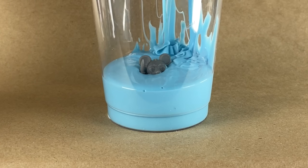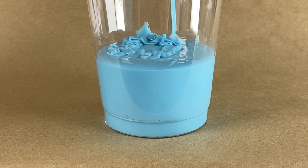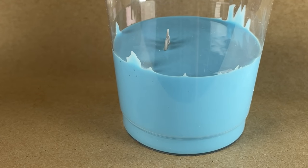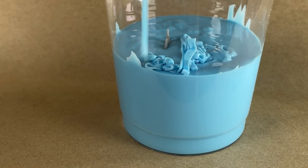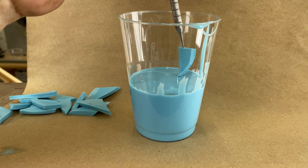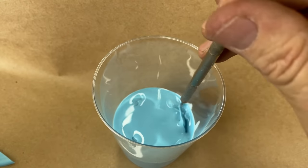I'm kind of waiting now because I see a gap between the sword and the ear and the side of the face, and I want to see that rubber rising up in there. Give it a nice eighth of an inch, quarter of an inch maybe, of rubber on top. Now I completely guesstimated how much rubber I was going to need for these three — just eyeballed it. We'll see if I have enough to cover the tip of that sword that's sticking up. Just shove in the chunkies — pieces of old molds — to fill up space. Let's wait 24 hours to see what happens.